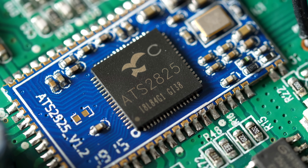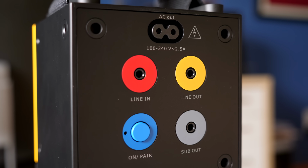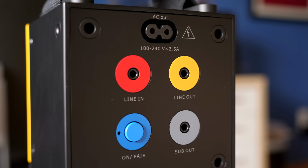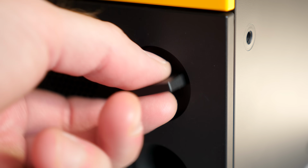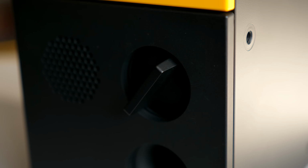It features an analog to digital converter to receive audio from the aux input jack and automatically switches between it and Bluetooth depending on if a cable's plugged in. It also has digital to analog converters for the output jacks too. Audio is always sent to those jacks regardless of the input source, and the volume level varies with the volume of the speaker itself. This is so you can control the volume of all the speakers you hook up from the first one in the chain.